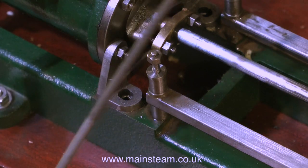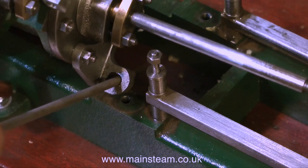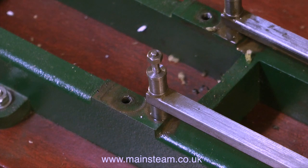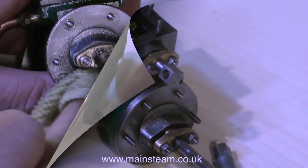With any engine that gets hot, it's better to make sure you have a little bit of float so you can adjust things, because if everything was perfect, then you're going to get things seizing up. And the good news is none of the bolts are sheared — they're all making very good contact with the threaded holes in the cast iron base.